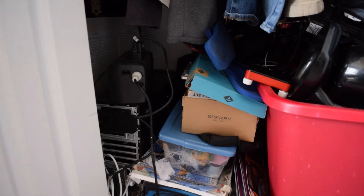We're going to be replacing the battery in my UPS because it won't run the server for more than about a minute and a half in its current state. That battery is still going to be put to use because I've got another UPS that I'm going to put the battery in — it's going to run my wireless router and network modem on the other floor, probably for about a half hour. I should have had the server shutting down while I was rambling on. There it goes.